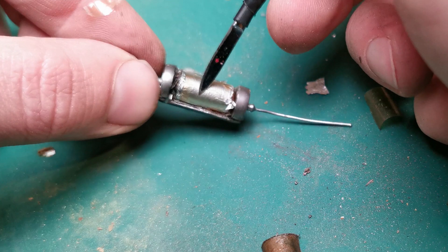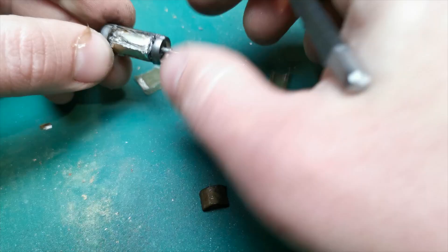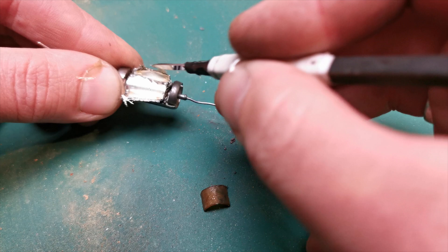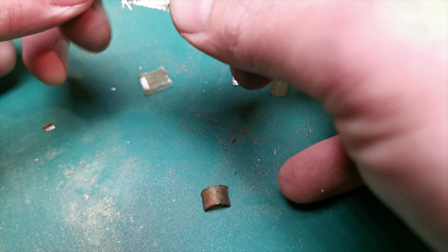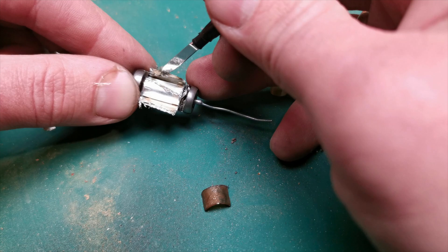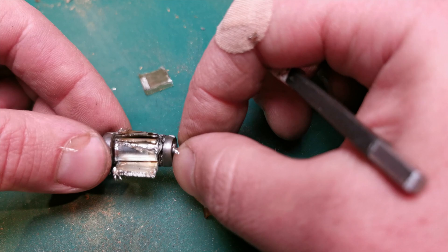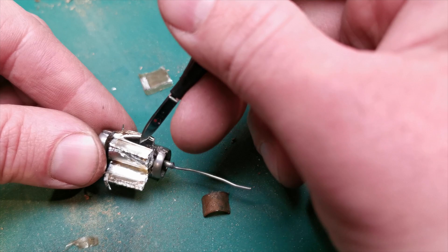This is in fact oil — oil paper is the insulation. If we unwind several turns, we can regulate its capacitance with these turns and the mass of film. You can make 0.022 from this capacitor — this is a 0.047 microfarad capacitor. We have already done this: stripped a capacitor and rewound it the required amount to reach the value we need, down to hundredths. I did this with a friend — we soldered an amplifier for about a year and a half from such capacitors, chose out of ten pieces, listened to three, rewound one to the denomination we needed, and it turned out to be a great amplifier.